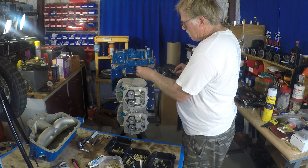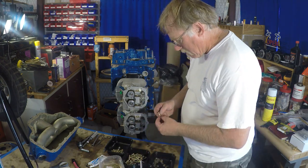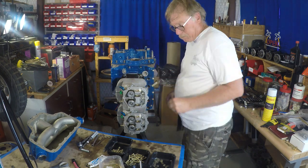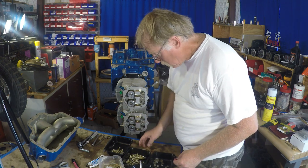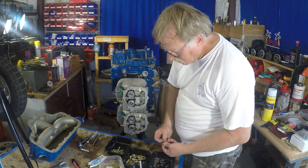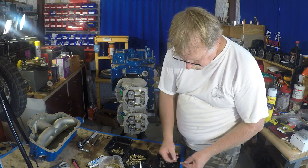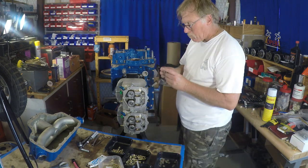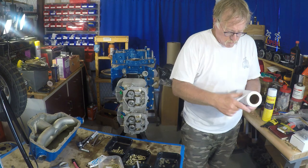So this is all the hardware that we had sent off in other episodes to get replated or replaced. So we're going through all that. Everything's getting lubricated and installed with new washers and lock washers. Most importantly, number one rule of aviation and probably everything, machinery: don't reuse lock washers. Throw them out and get new ones. They're cheap and they should not be reused, whether they're the internal star, external star, or a split lock. Always put new lock washers on.